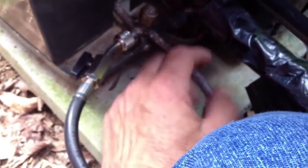There was no way I was going to cut all this stuff off, let it set for 24 hours, and go through all that — just to find this. Because it is a heat pump, I was fortunate enough to be able to close everything off and then use one hose for my condenser for my outdoor unit and one hose for my line set coil. This line set goes from this unit, goes around, down on the ground, up through the hole, into the laundry room where the unit is.